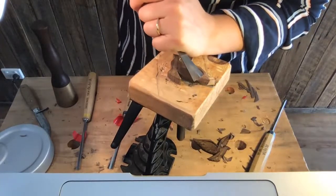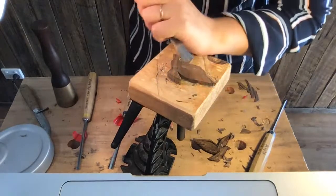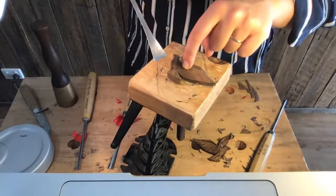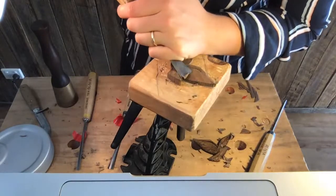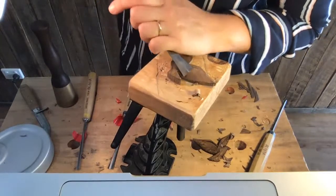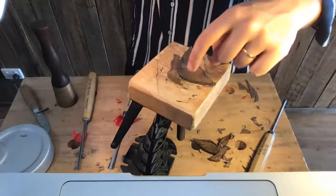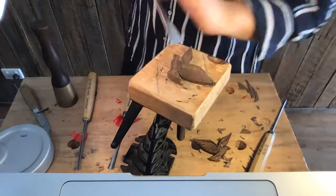Just using a corner tool. That probably needs to come down a little bit more. Now can you see I'm actually rocking that tool? Especially here — it's sounding so nice because I'm slicing off end grain right in there. So I'm really twisting it to make sure I'm slicing and not just butting into anything or ripping. I'm going to take it deeper this side than this point up here because I want the wing to kind of be coming up a little bit at the end.